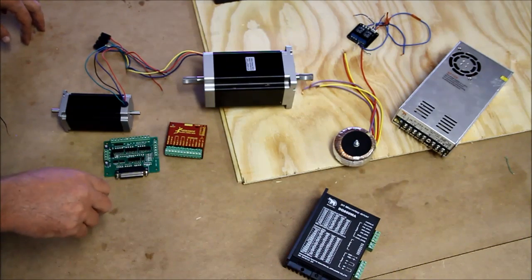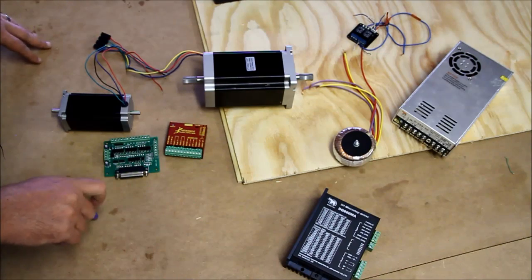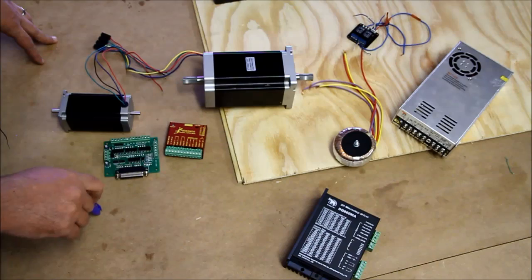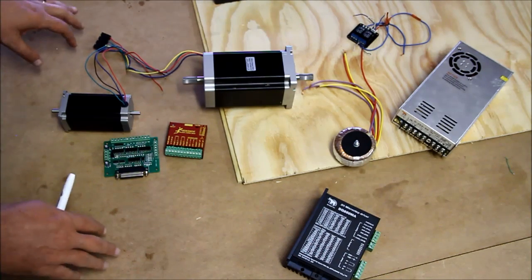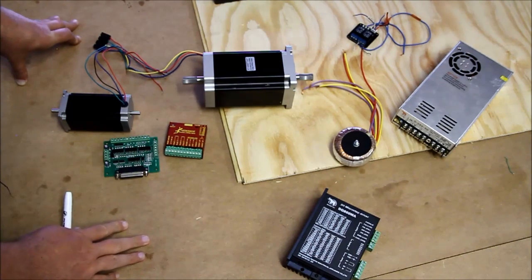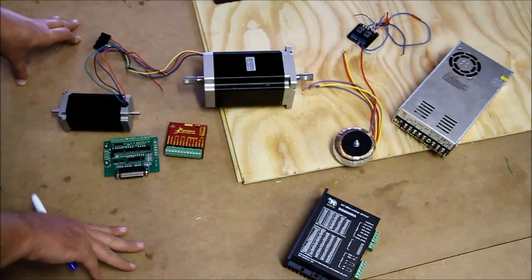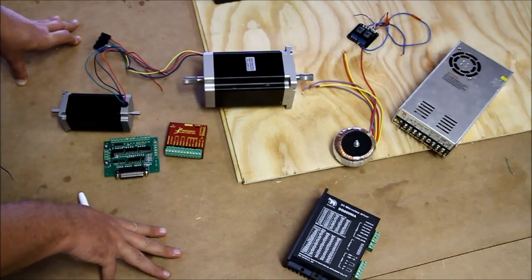There are also cables with EMI shielding — you might get interference on bare cables, especially with plasma. Mine are bare and I don't have a problem yet. I do run an Ethernet Smooth Stepper which helps, because parallel ports are also known to get interference. Earthing is quite important as well, but we can discuss that in another segment.